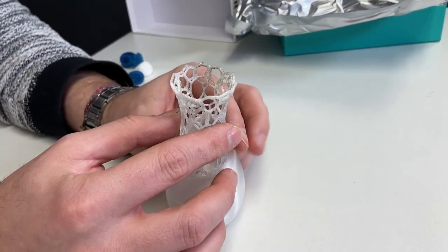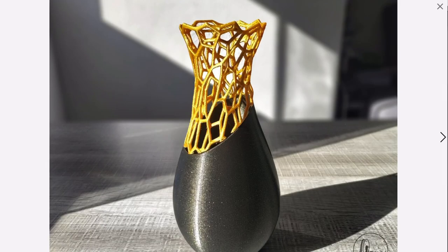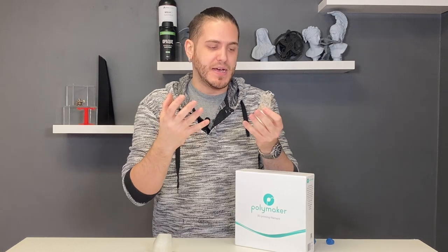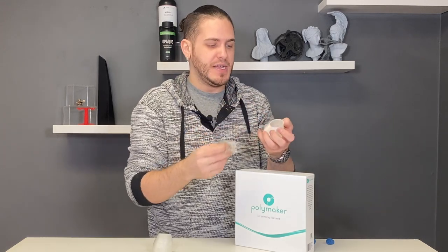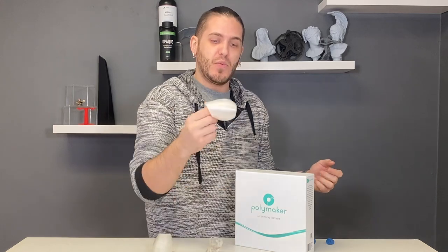This is the Voronoi base from Prusa Printers — I'll have a link below — and it's a great model. I scaled it down to 60% because of its sheer size. I want to cast this in bronze as a hollow object. My setup is designed for jewelry but is a bit larger than some centrifuge-based setups. There are foundries casting full bronze statues, and depending on your machine, there's no reason you can't go full body size with this type of filament.